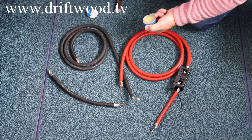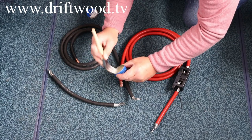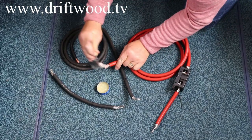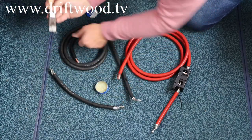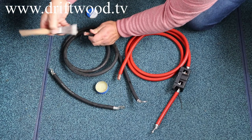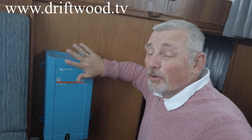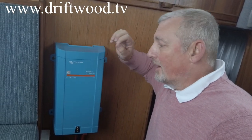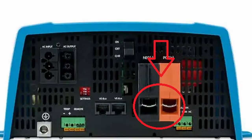One of the things I like to do is use petroleum jelly or Vaseline on all the electrical connections — it just stops them corroding. The best way to do that is to get an old paintbrush, which gets the Vaseline in between all the strands of copper wire. That'll help protect them from dampness and stop bad corroded connections in years and months to come. This is where I'm going to mount the unit — I just have it offered up here to check cable lengths before securing it to the wall.